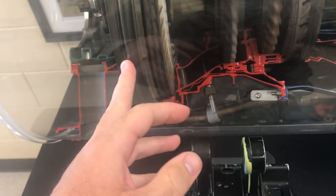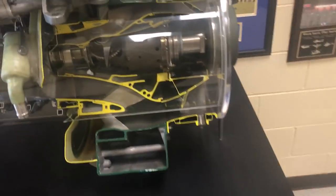I took the power control lever over to idle. The fuel has stopped. The power turbine slows down and we've got the engine slowly winding down as the motor turns off.